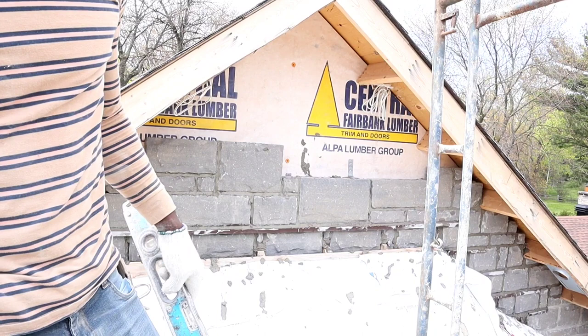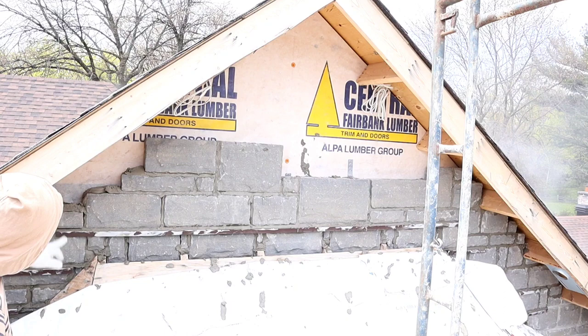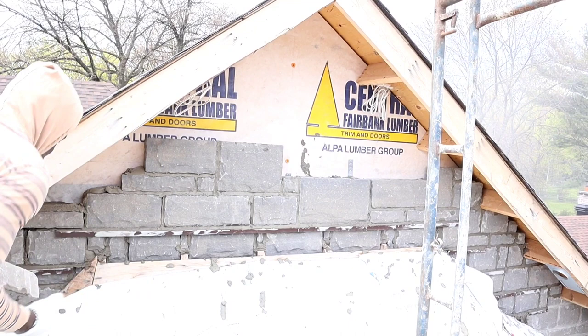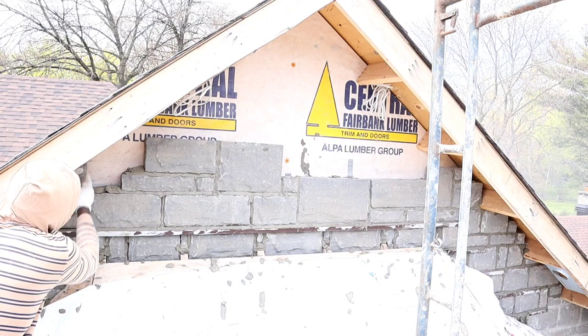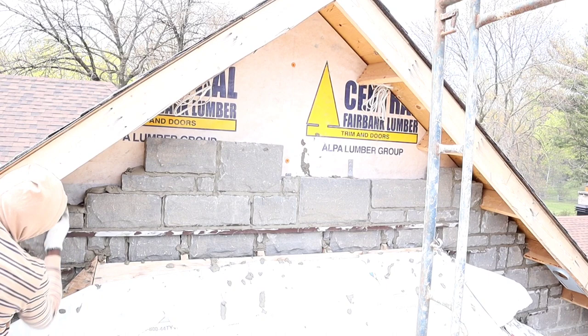So here we have a small stone. We have two choices. Here we're only allowed to put a medium or we could put a big. And if you aim for the big from here, then the joint's gonna go more than the rule, which is 10 inches. So for instance, I'm gonna show you guys. This is a big stone. I'm gonna put a big right here; now it will go more than 10 inches. You don't want that. So now you're only allowed to put a medium here. You could put a medium from here, and then you could put a big over the big side. Now we're gonna put a medium.